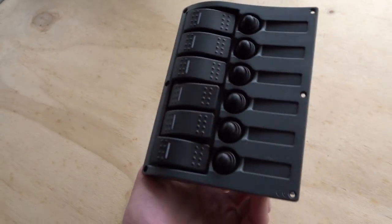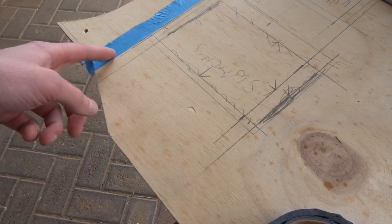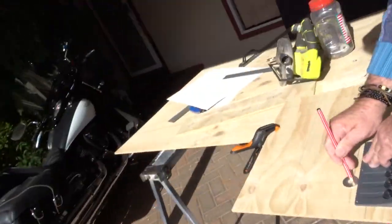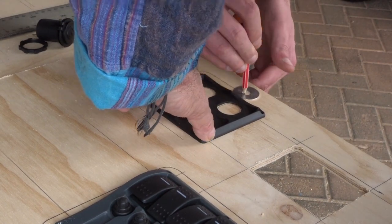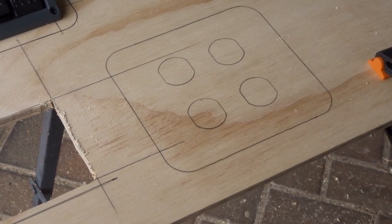So what we're doing is we've got the switchboard here, and it's going to go through the panel here. I'm just marking out exactly where we're putting it. It's a little bit hard — we haven't got much room. We've got to this blue line here, and then here's where the cupboard comes to. So we've got that little bit of panel there. We're cutting a border around, and to get the exact same size all the way around we're using a washer. So all we've got to do now is cut that out.